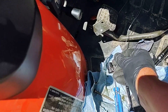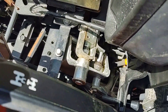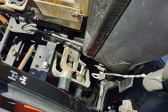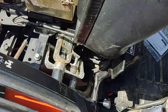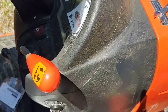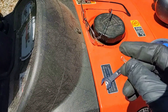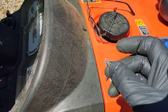This part was by far the trickiest. You have to get a pin down into that mechanism. I used a piece of wire twisted into a makeshift tool — I lowered it down there, got it into the hole, lined it up first with an allen wrench, then used the wire tool to drop the pin in and push it with a screwdriver. The next really tricky part is going to be putting a cotter pin in there to pin it all together.